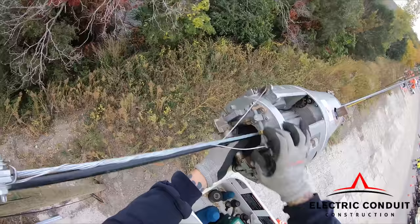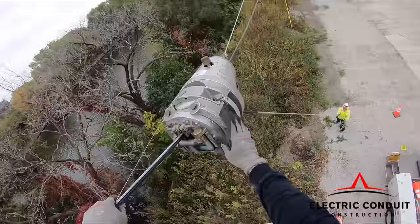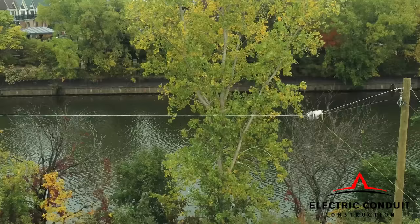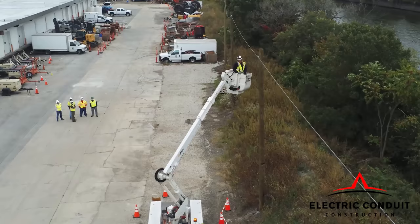He's adjusting the back gate for the size of the package to be lashed. So as he's pulling the lasher, it's dual lashing that fiber up tight to the strand to the next pole. And then it'll be secured with a bug nut at that side as well.